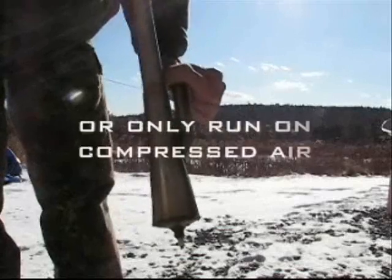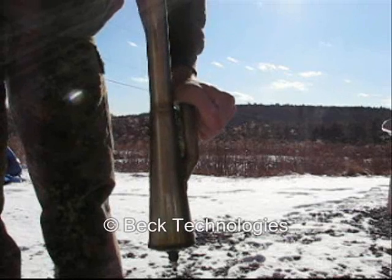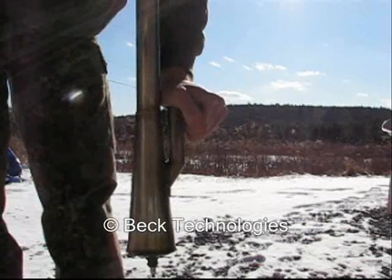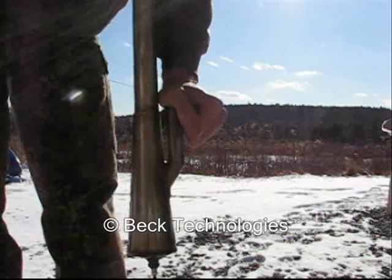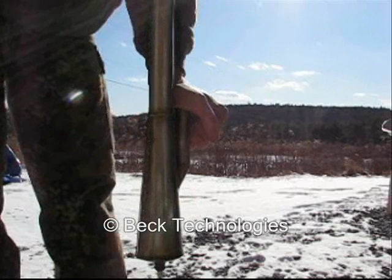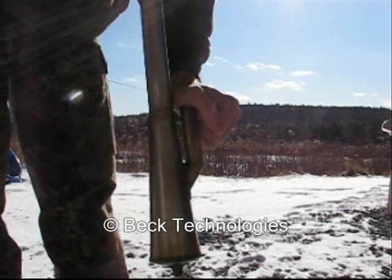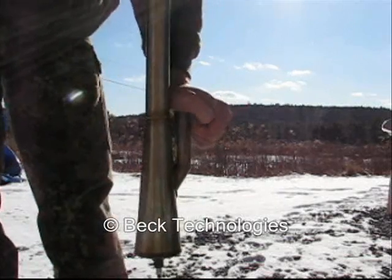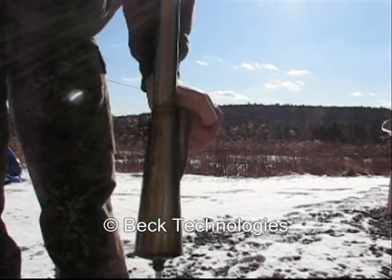This is just a leak test to make sure all the welds are totally leak free. We do this with all the engines. A little engine like this can run with a few little leaks, but the more leaks there are, the less it will run well and the throttle will be a lot worse. If you're going to run it on liquid fuel, you absolutely need it to be leak free. The little spot welded engines that are flooded on eBay these days are definitely not very good.